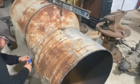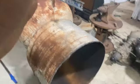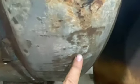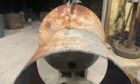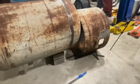You kind of see this. I'll show y'all. You can see the mark coming, and this is 4 inches, so you're gonna run that up. That's gonna be a flat cut on the bottom because it's a flat nose end cap firebox. And then this side, like I said, it's never really perfect, but that's the best way we figured out. Now it's time to mark it up real good and get to cutting that thing.